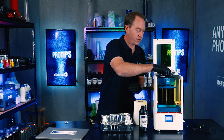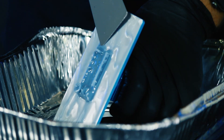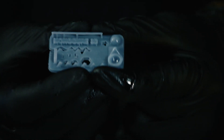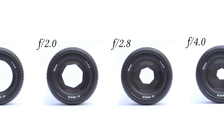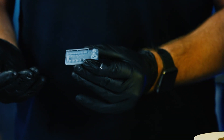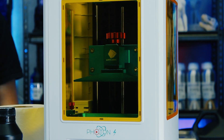The print's finished — good news is there's something on the build plate, always a good sign. Let's take it off using a scraper as normal; it has relatively good adhesion. You can see straight away it's over-cured by a number of seconds. The best way to explain overexposure is like a stills camera: if the aperture is open too long, too much light blows out the picture. The same happens with a resin 3D printer — if you expose for too long, the objects come out bigger than they should be, losing detail. With Monocure 3D there's no detail visible, and the whole point of resin printing is high detail. It's a matter of balancing layer height with exposure duration. Let's try 7 seconds per layer at 50 microns.